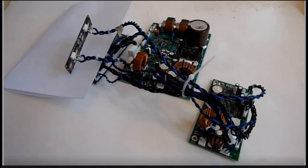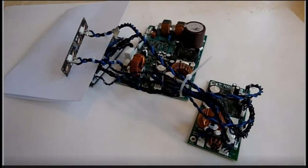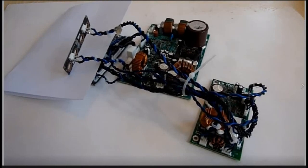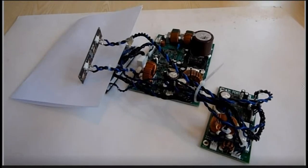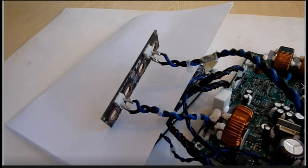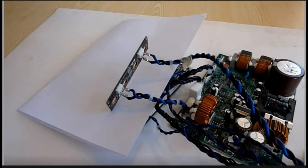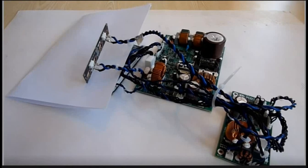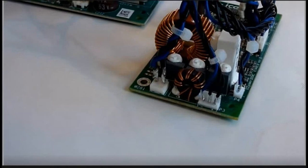In this type of application I'm not a big fan of mechanical terminals, and that is based on experience I have from soldering the interconnects directly into my CD player and turntable, where the sonic improvement was very encouraging. On these amplifiers I started by substituting the mechanical terminals on the wires that go from the amplifying boards to the small board located at the rear of the binding terminals for the speaker cables. After testing the amplifier with these modifications, the sonic improvement was so encouraging that I decided to continue removing and substituting the mechanical terminals with solderings. This is what it looks like when I have soldered the wires directly to the boards.